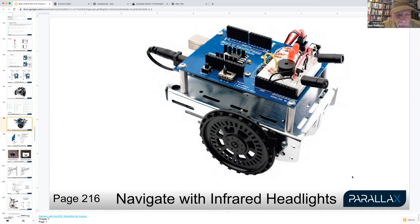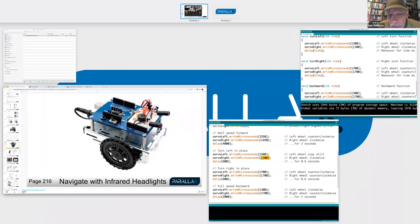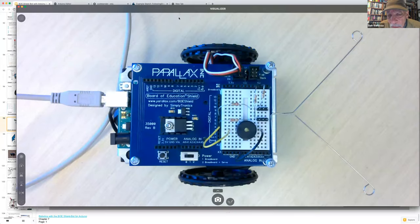Yeah, when you're going inside of the white breadboard, you could really feel you've got a real solid connection. It's true. And it is a little looser on the 5-volt end. It's not quite as tight as the breadboard, but I'm still getting a decent squeeze as I insert it. Let me switch over to this one. Yeah, because I had a situation where the code was working and then it wouldn't work, same setup. And then I started investigating and I said, wait a minute, I've got a loose connection here.